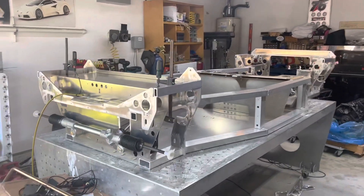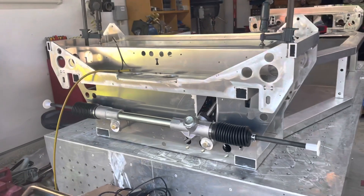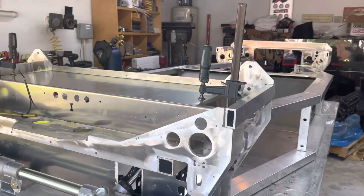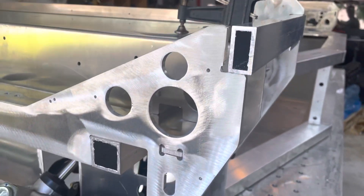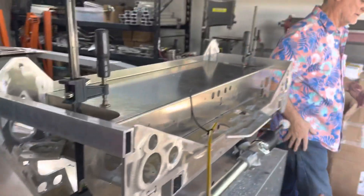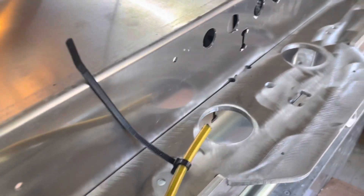I'm back, and while I didn't get done anywhere near what I was hoping to do today, Charlie's been working and getting a lot done. He has the chassis mocked up — he had the welder come and weld up the frame rails, and everything else is just mocked up. The exception is the steering, which is bolted in but will be unbolted soon. Everything he did uses a slot and tab configuration, or it meets with another piece of tubing or metal, so all we had to do was put the little slots and tabs in and friction holds most of it together. There were a few places where clamps had to be used because things wouldn't stay due to gravity.